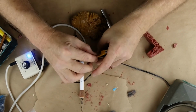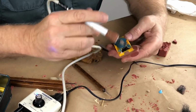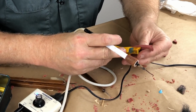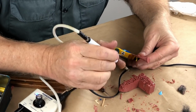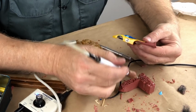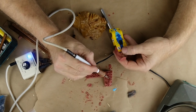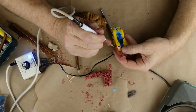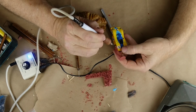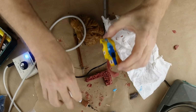Okay, it's an odd shaped sprue. It's a kind of a difficult sprue to attach for that reason. But there's nothing about this car that's funny and easy. Not anything. So we'll go with it. Just go along here and weld the funnel and the sprue to the body. Make sure that's melted on there well. Looking pretty good. All right, this is long enough.